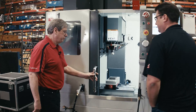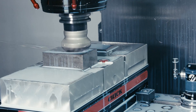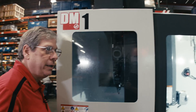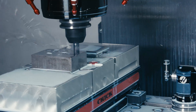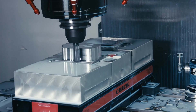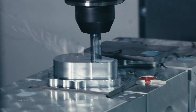Can we see it cut? Sure. Right there with this cut, that's definitely something you wouldn't be doing with a drill tap machine. Exactly — it kind of puts the M in DM1. As a matter of fact, the M does stand for milling; it's a more aggressive milling machine than the DT1. This tool is a great example of the type of milling that wouldn't be possible on a DT1 — this is what you'd call a 40-taper milling application. It's a large depth of cut, requires a fair amount of power, and that smaller 30-taper spindle just isn't up to that.